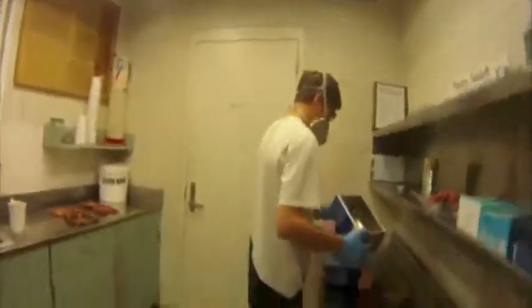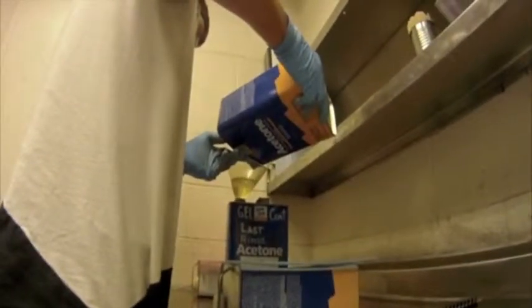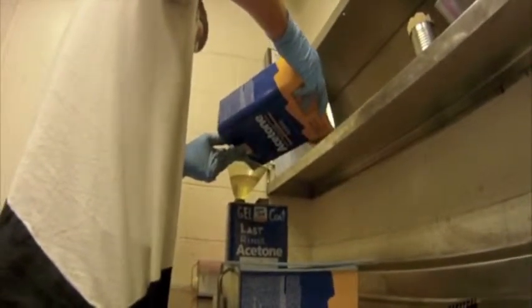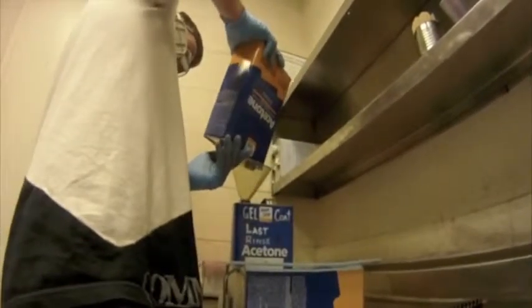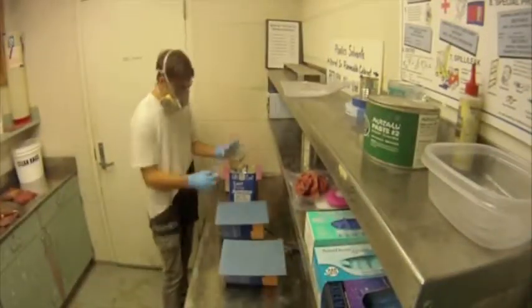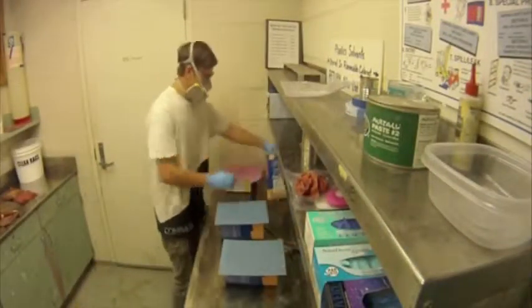Make note, if one of the baths has an excessive amount of gel coat resin, to dispose of the bath in the flammables cabinet as well. After pouring all the acetone into the appropriate container, then place the plastic lids on top of all 3 acetone baths.